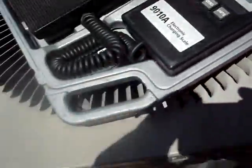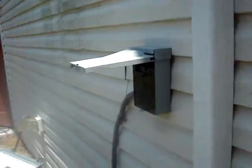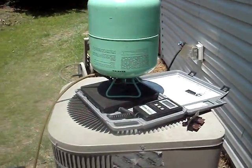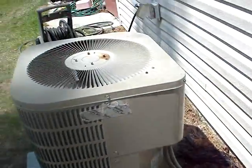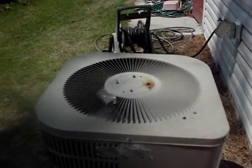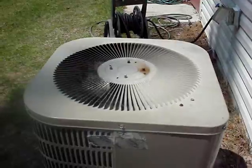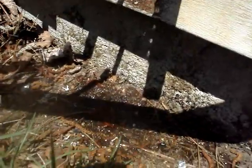We're charging it up now — about a pound in there. We need just over six pounds, then we'll start her up and see how she does. Alright, we're all done. I calculated the superheat and it's right on the money. There's our filter dryer, disconnecting stuff — everything's working out good. It's already cooled down three degrees in the house in half an hour, which is pretty good when it's 95 outside. You can see our drain there — it's really humid inside, you can tell. I think we can call this one a victory.